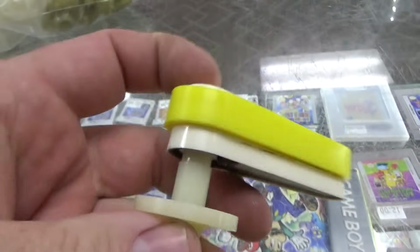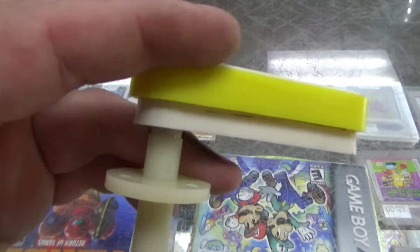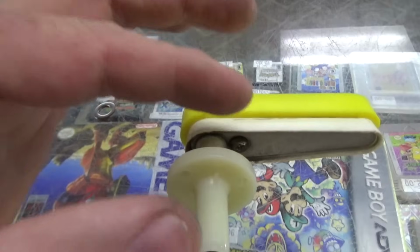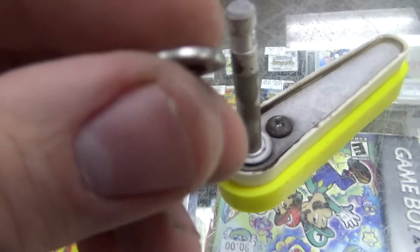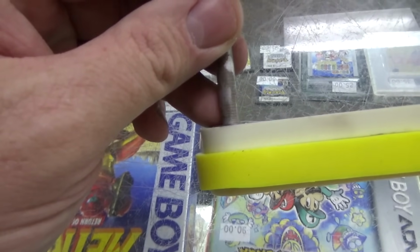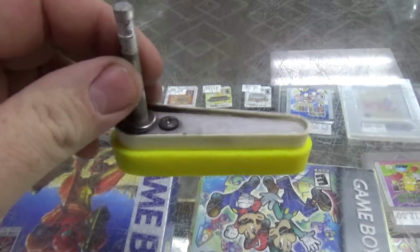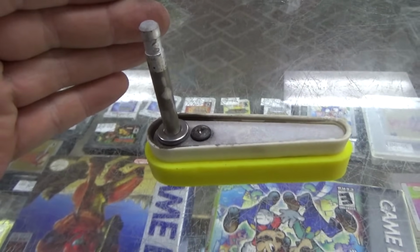But you can see there's a bunch of play in it because of that screw, right? But that shouldn't allow it to go too low. But what can happen is the whole thing can get bent where the tip of it's bent down. And still, it shouldn't be rubbing the Playfield. But what I've been doing to make it sit just slightly higher on the Playfield is putting a little washer on it. Now it'll sit just slightly higher, just barely, the width of that washer. So I'll tighten that up and put a little washer on it, and that will raise it up just barely so that it won't hit the Playfield at all. And we'll take care of our drag problem where it's cutting the paint off the Playfield that we just went through so much trouble to fix up.